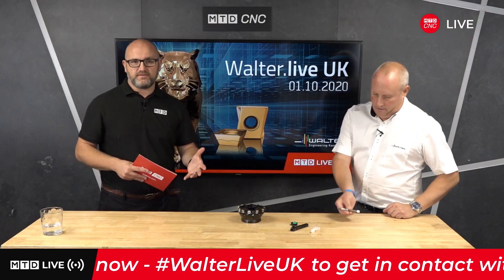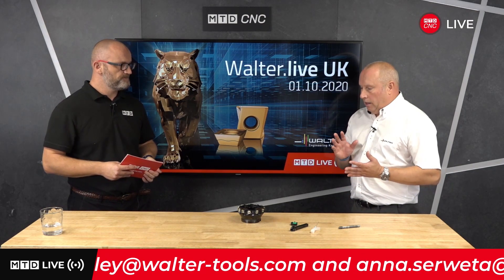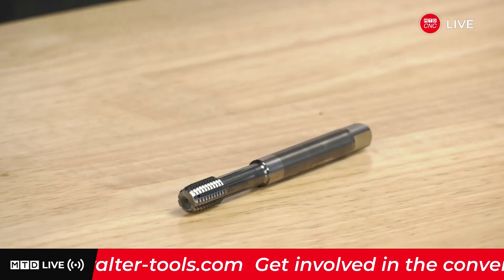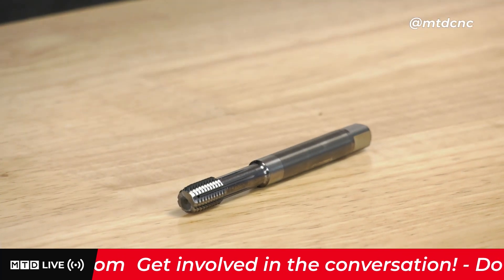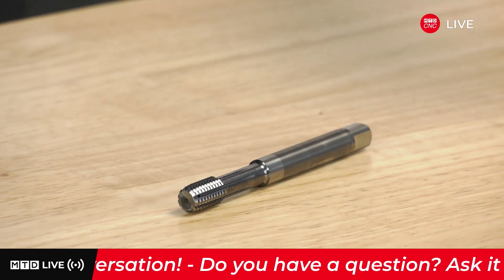If you're watching this, please come to us with pros and cons against roll tapping. Should you look at carbide taps rather than HSS PM or HSS materials? You've also got to consider how you hold the tool. Why should engineers use a soft synchro tap adapter? With carbide, I'd always recommend a soft synchro for small diameter taps. On any machine tool, the Z axis and spindle are orientated together, but you'll always get some mismatch between the servos. The soft synchro compensates for that, giving you a more secure process, more tool life, and a better quality thread.